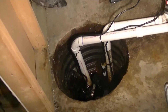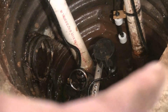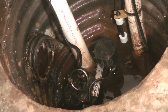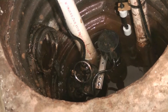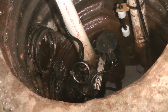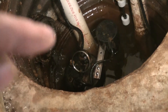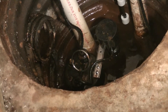I'm happy with the way this setup is now. My main pump is right here, my backup pump is just out of view under the lip of the cement, and I have my float for the battery backup set where I like it. This setup would be perfect probably 90% of the time, but last summer — if you check mid-Michigan flooding history — we had a major flood here. My one pump was running full time and could not keep up because there was so much water and the woods were flooded right outside my house. That's why I added the second pump set just higher. I'll have the main pump, a battery backup pump, and a secondary pump — and we should be good. Hopefully we never have a problem again.